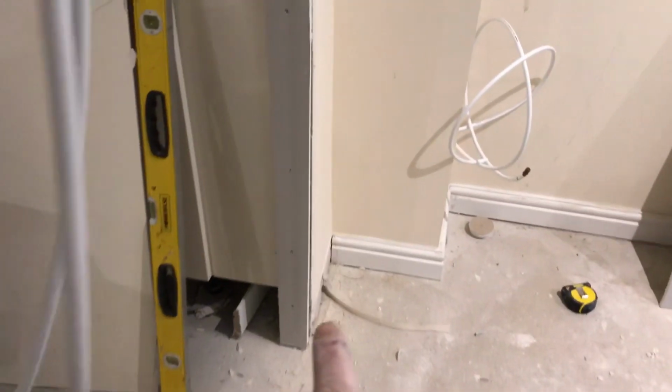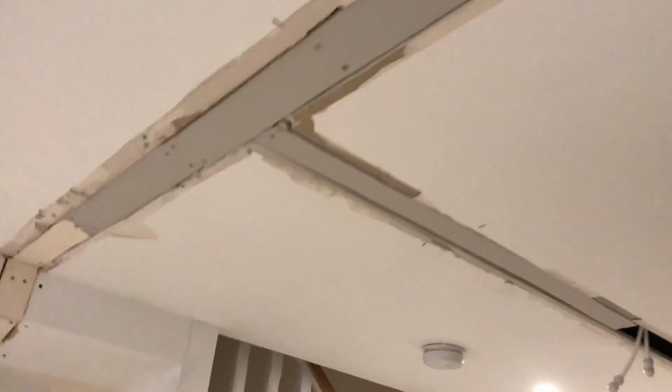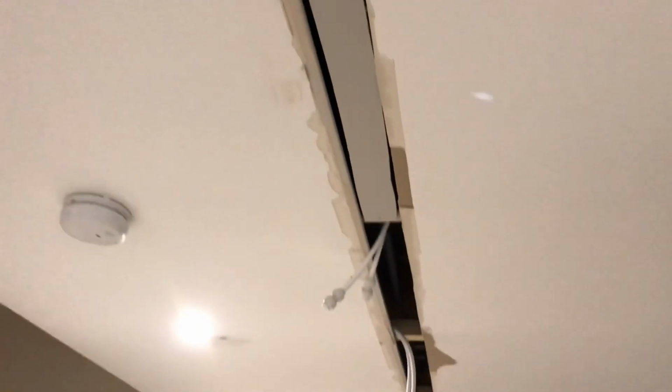Okay, we're getting somewhere now. This nib's plasterboarded now. I had to put a timber in there, sat between the metals. Butts up to that one. I've had to leave that out for the plumber to do his joint. I've plasterboarded this now. All I've got to do now is scrim tape.